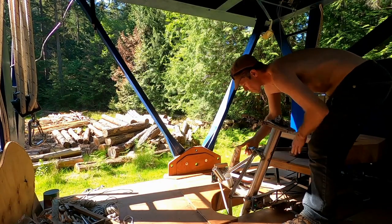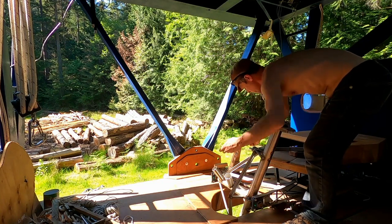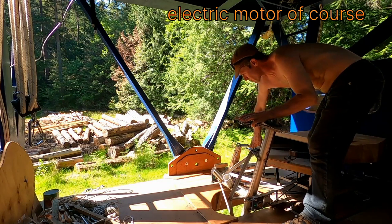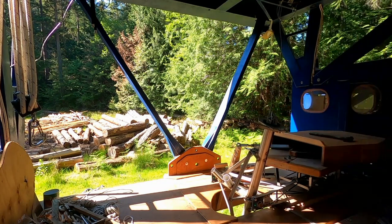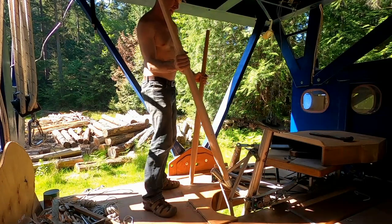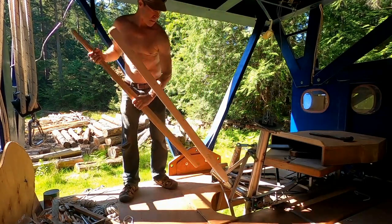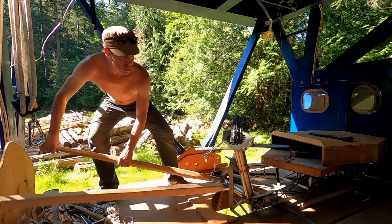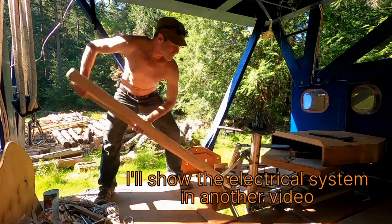So it's based on like a 9 horsepower motor. The gearing takes it down from 3000 RPM to 30 RPM, so 100-to-1 ratio in 2 sets of gears. And with a 45 degree pitch on the blade, on the fin, and with a 10 foot sweep, that should be about 6 knots.